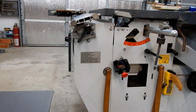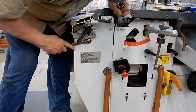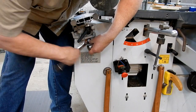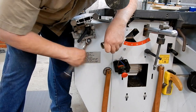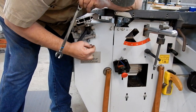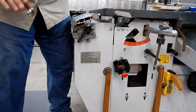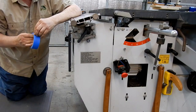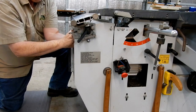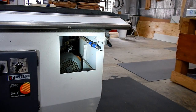We're going to take loose the nut that holds the angle adjustment lever on your saw — 17mm. Make sure you've loosened off just about half a turn on that first. I'm going to take some tape and put it around that shaft on either side of this nut so we mark the position of the shaft. The position of where this nut rides on the shaft is essential — it's going to make a difference on whether you get your full 45-degree range. First time I took this off, I did not mark the shaft like this, and I put it back together and it wouldn't go full range. You can see where I put the tape around that shaft — now you're able to pull that out and free it up.